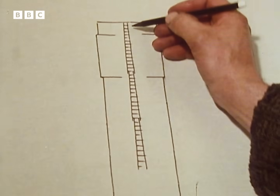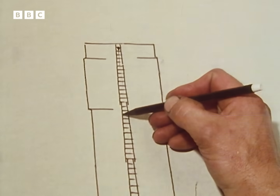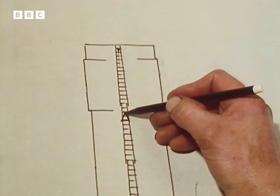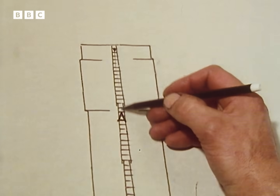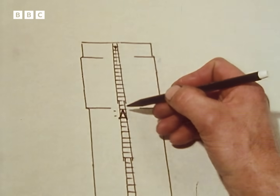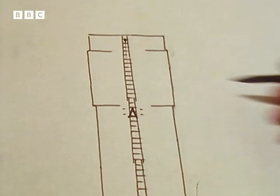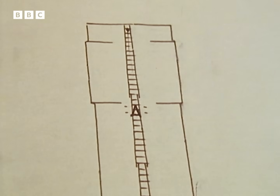The first thing I've got to do is get my bosun's chair up, and then I'm dangling somewhere round about here on my three bits of rope and a little board. I then have to chisel four holes into the brickwork, six inches apart in a vertical plane and a couple of foot apart the other way.